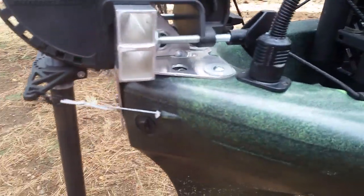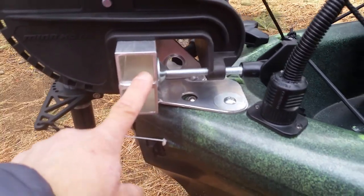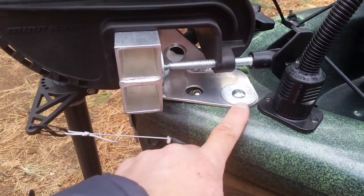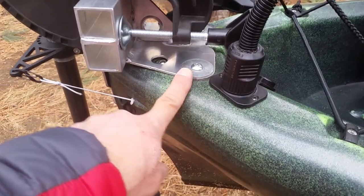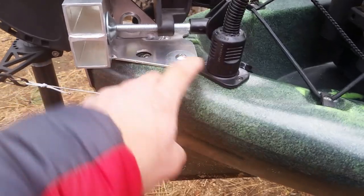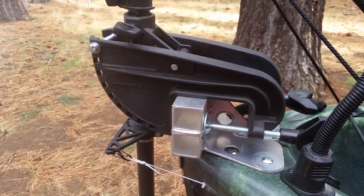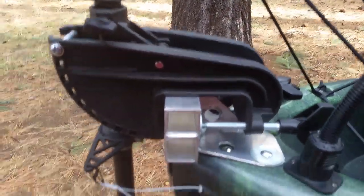I had a fabricator friend of mine build this false transom, similar to what Bass Yaks and other manufacturers do, as well as a lot of people who have built their own. It is aluminum. We've got t-nuts I got from a ski shop — they're from a ski boot. I very carefully fished them into the hull of the kayak; they bite in from the backside and allow you to put a bolt in from the top. We also have a Minn Kota twist-lock plug so it can't come out. I was able to maintain the Minn Kota C-clamp, but I removed the pivot hardware that locks it in place — and we'll see why in a minute.